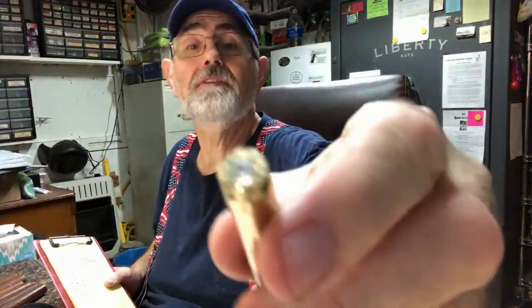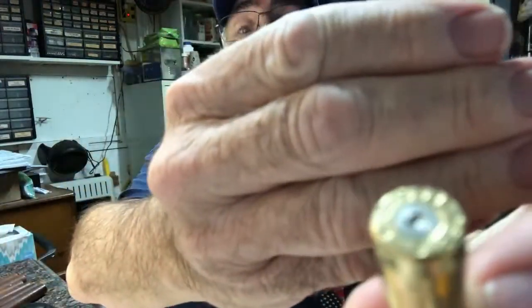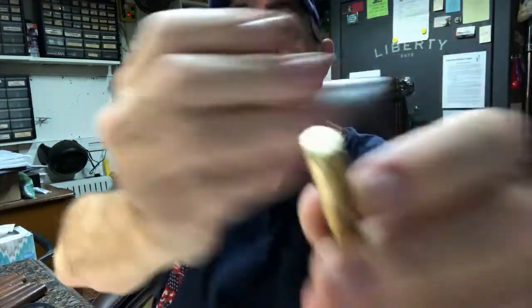The reason it made me do that — I got all close-up pictures of these because you probably won't be able to see it very good. Those primers definitely show pressure problems. They're flattened. That was the second from the beginning, at 22.7 grains. The only reason I don't know about 22.4 is I threw them back in the bucket so I couldn't tell which ones they were.